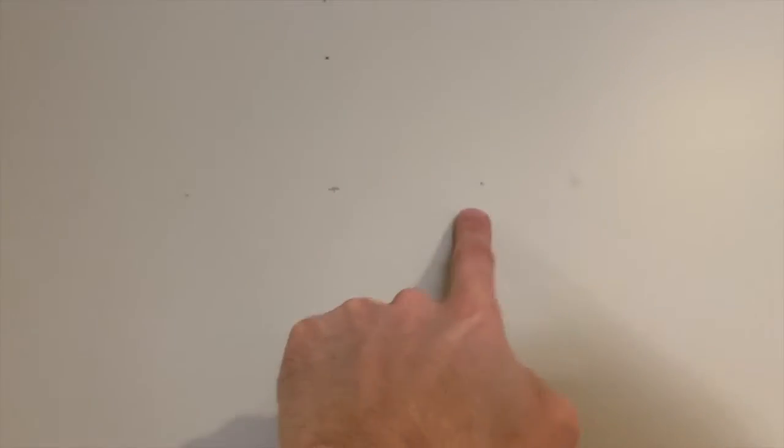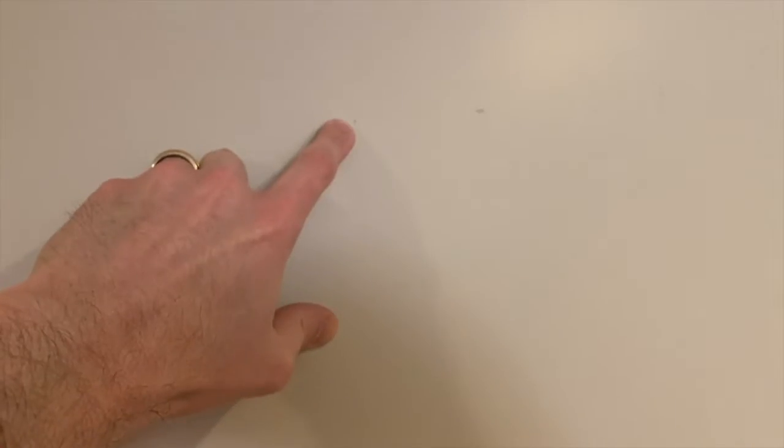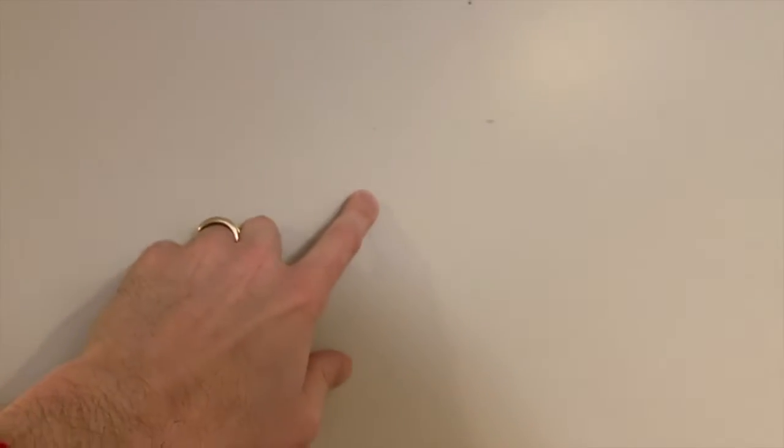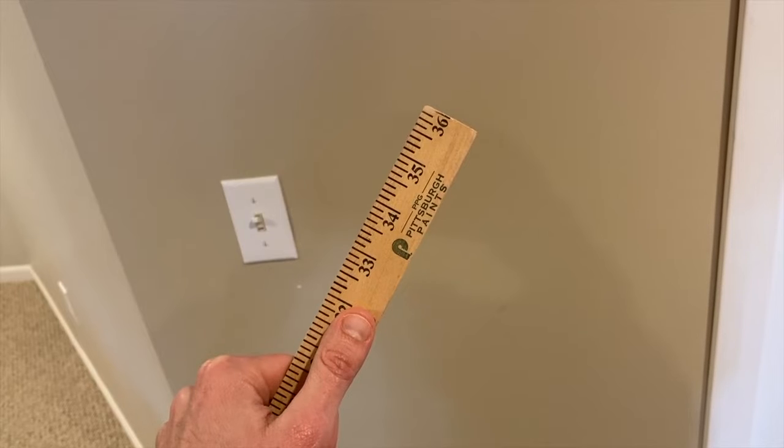Again, there and there. Then what you want to do is just verify yours is like ours. In our case, it is exactly 36 inches or 3 feet down to the lower anchor cutouts there. So what we will do is measure from each outer point down 36 or 3 feet and make our lower markings. And trust me, DIYers, it definitely helps having a 3-foot or 36-inch yardstick.